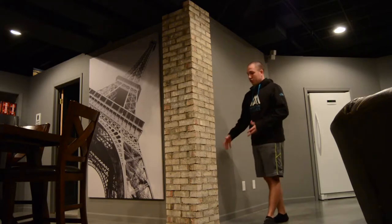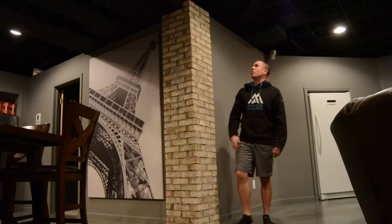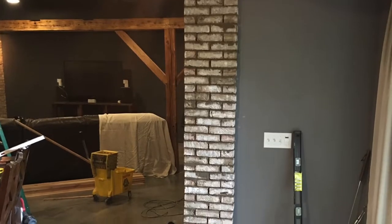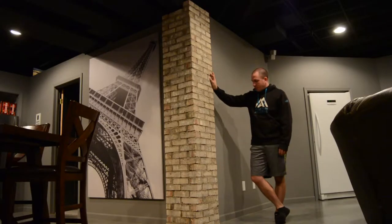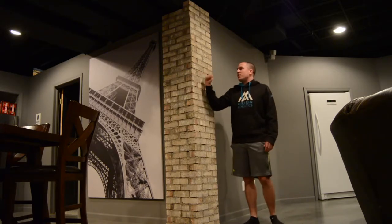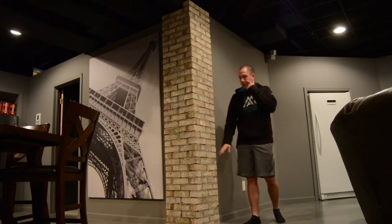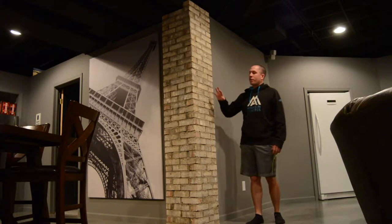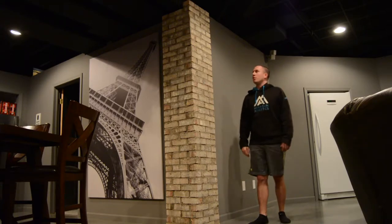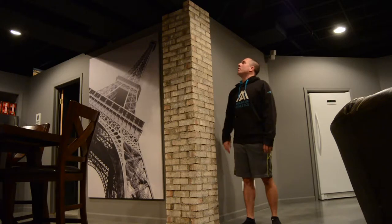These are full brick — the color is Knob Hill. I hand-built this wall. I'm not a masonry guy; I do a lot of premium tile work, but as far as masonry and building a block wall, this was my first time and it came out pretty nice. I just literally stacked it up, so if I ever need to do work on the jack post, these bricks have to come down. Behind this brick here are three lolly columns sitting on a two-foot-by-two-foot footer supporting the corner beam of the house — very crucial, going all the way up to the second story.